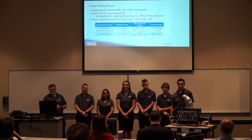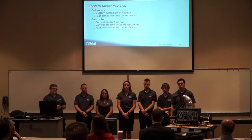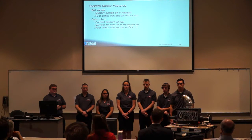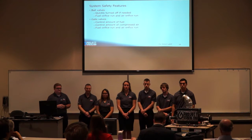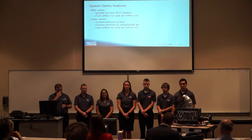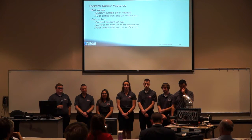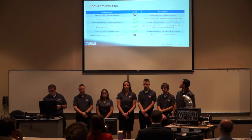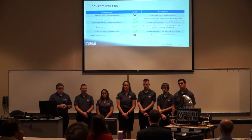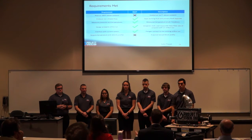Slide 38 discusses system safety features. Was a check valve considered on the propane line? It is actually part of the pressure regulator. On requirements, you met four out of six. How would you get to all six? As far as heating the air to 300°F, we achieved 167°F after a lot of tunability work. The combustion side of this project was challenging — we designed a great heat exchanger, but achieving uniform temperature distribution doesn't normally happen easily. Going forward, we'd like to explore different fuel pressures, different compressor manifold pressures, and different burner tubes. There was CFD analysis done on hole sizing, but the lead time on fabricating variable-diameter holes was too long, so we went with the current design as a good starting point.